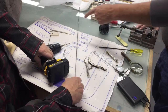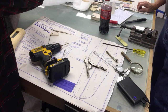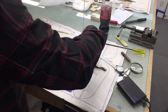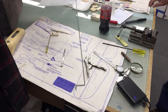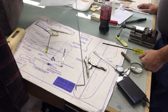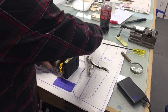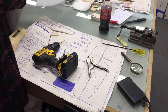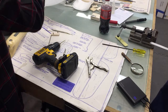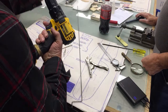I need to get a 1/8 inch wheel collar out and put on there so you're not going so deep. Well, almost. You want to number drill it? Inside? I don't go down that small. 128. I think it's the number 40. Put this 43 here. Put that in there. Don't waller it out.